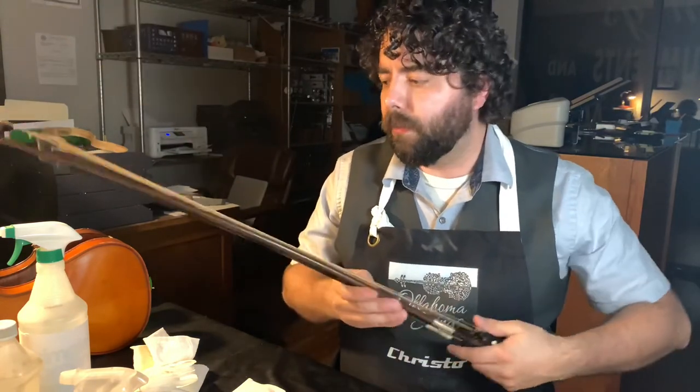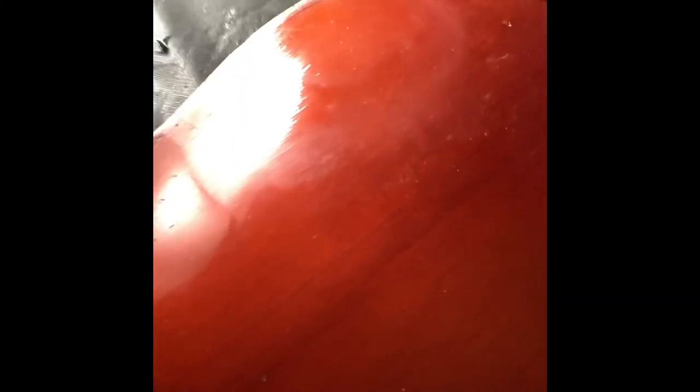Okay, all the warnings done. Bottom line: don't do it, and if you're going to do it, be careful and do it right. Here's a quick follow-up — it's been a couple of hours for everything to dry. In the top left you can see the result of the hand sanitizer. You can see the swirl pattern; if we keep going we'd damage that varnish even further. What that actually is is the varnish being melted by the chemicals, leaving it really dull. So that one is definitely a no.